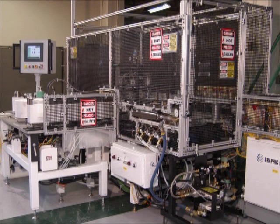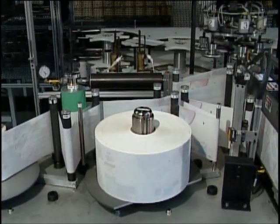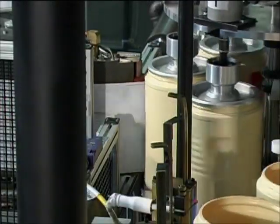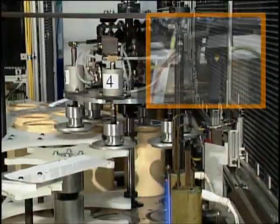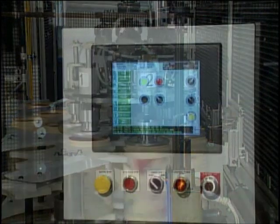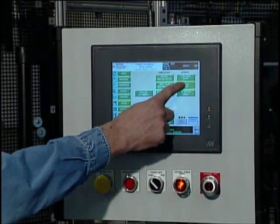This new HTD 720 servo round decorating technology provides many new features, such as the ability to handle larger roll sizes for greater machine uptime, the ability to decorate larger areas of the container with a linear applicator, servo motor controls allowing for the highest label placement accuracy, and a color touch screen control panel for ease of operation.